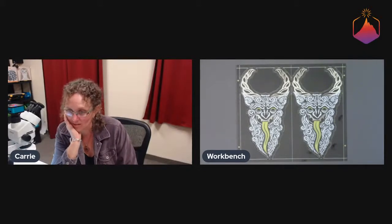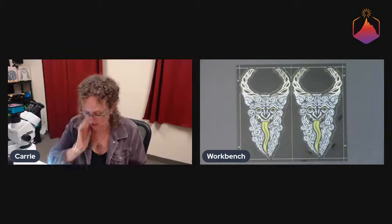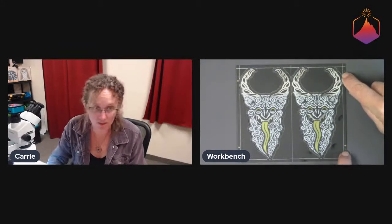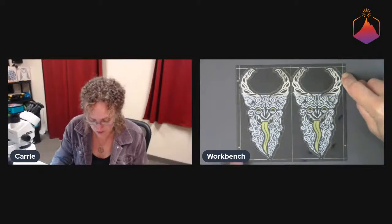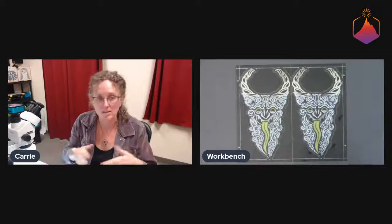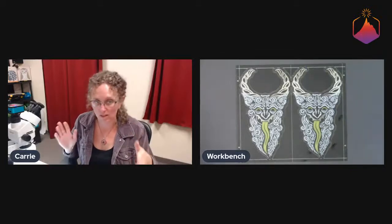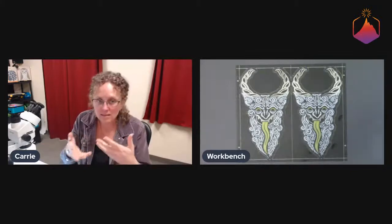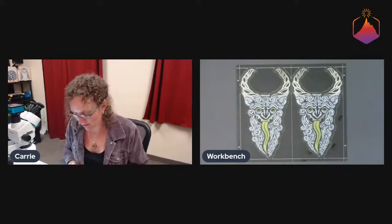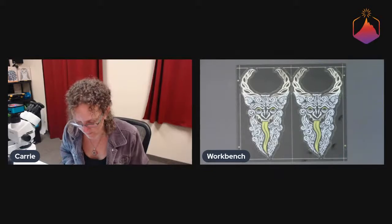Yes, it would make it a lot easier to register the alignment pins in the fixture jig. So the alignment pins go into these tiny holes. Fortunately, we had alignment pins that were small enough to do that. Our stencil alignment fixture came with a nice little assortment of little pins and stuff to help you do this kind of thing. Usually I'm used to seeing larger holes from US board manufacturers in here, so it was nice that those actually did work.